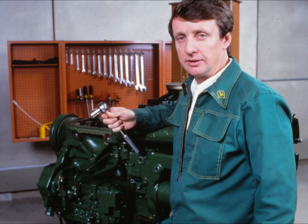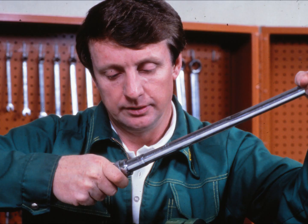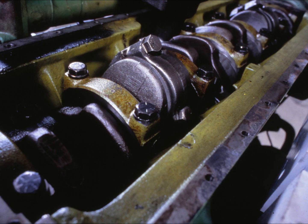In summary, fasteners don't simply hold parts together. They stretch when you tighten them and the resulting tension clamps the parts tightly. The amount of stretch you put on a fastener is crucial. Too little stretch and the parts may come loose; too much stretch and you may weaken or break the fastener. A torque wrench indirectly measures the tension on a fastener, but the torque measurement can be inaccurate. A torque wrench is accurate enough for most applications, but some critical applications need more accuracy than a torque wrench can provide. So John Deere recommends that you use the torque turn method in those cases.